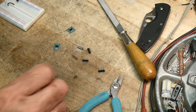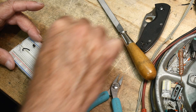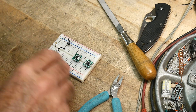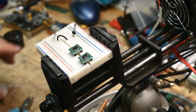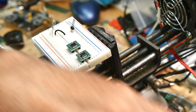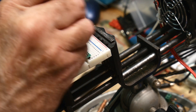Now I'm going to put the pins in. Here's a trick: in order to get the part on there nice and straight, I use a proto board to hold everything together while I do the soldering. I'll just stick these on here — little guy on top. And now when I solder it down, everything will be nice and straight. Let me heat up the soldering iron. There we go — perfect. Got quite a bit of flux on them, so I think I'll take the flux off. Just using some ethanol to make them look pretty — why not? If I'm going to be staring at them, I want them to look pretty.